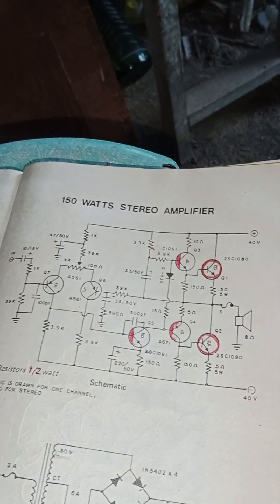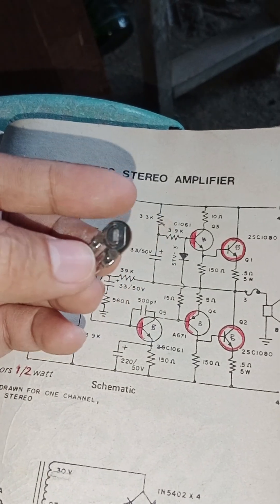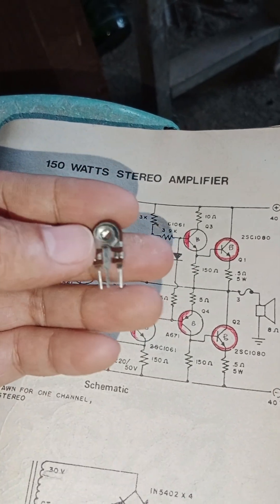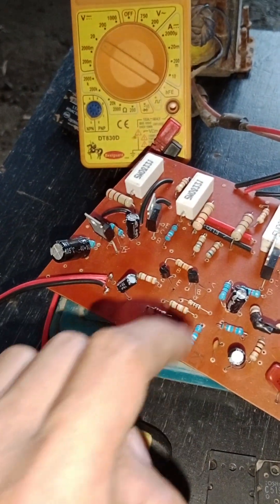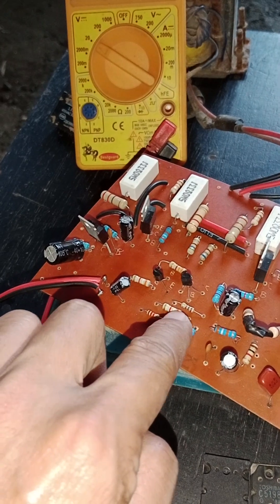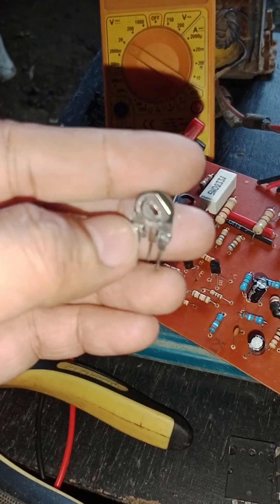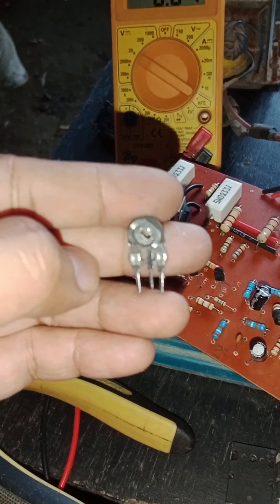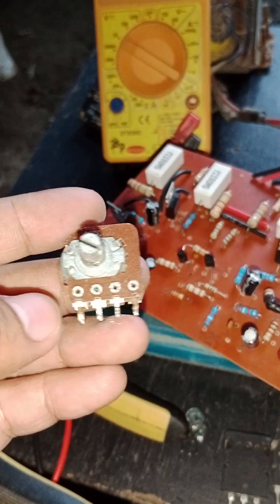As you can see, there's a trimmer here — 100 ohms. But I searched the market and couldn't find a 100-ohm one, so I bought a 15k (15,000-ohm) trimmer. However, in this build, there's no trimmer at all — I replaced it with a resistor divider. For those who don't know, a trimmer is basically a miniaturized volume control.